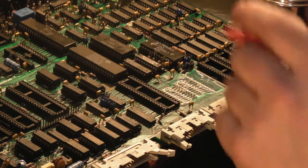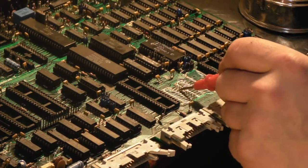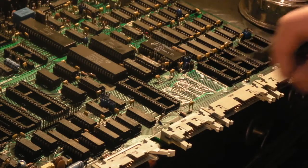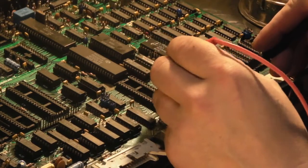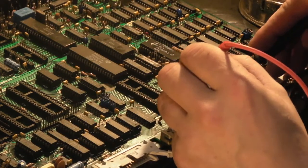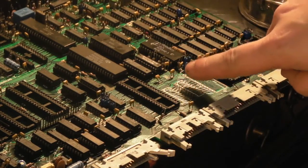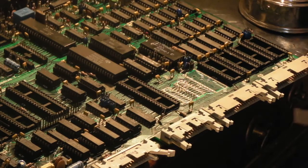Like between this IC71, there's traces that go between the pins on IC72. And it's them that seem to have got damaged. So let's have a look here. That's fine, we've already tested that. That one goes in the opposite direction, so that's okay, because we didn't do any damage around IC71. It's all towards IC72. Like I said, my blade slipped when I was trying to cut the chip off, and it went into the board. That's what's caused all these issues.